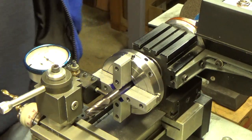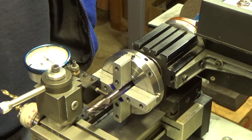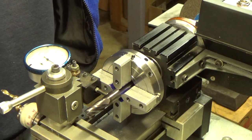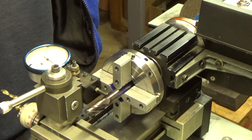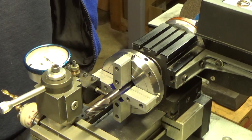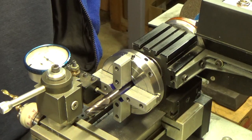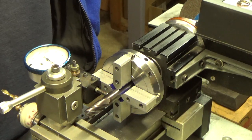I've got a half-inch end mill in there, and I'm thinking the shaft is pretty true on that — if it's out at all, it's out tenths of a thousandth. For these chucks it probably doesn't make much difference. These chucks aren't totally accurate; you can get much more accuracy using the regular independent four-jaw chuck, which is what I pretty much use all the time anymore. I don't fool with these scroll chucks anymore — not even on my mini lathe, where I have a four-jaw independent that I use almost exclusively.